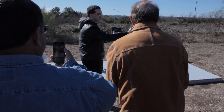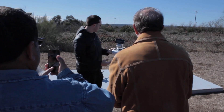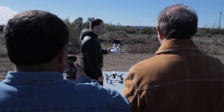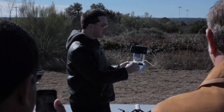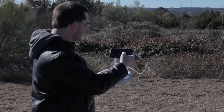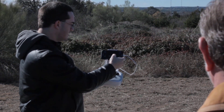Just like Robert probably demonstrated on these, we don't want to fly until we've calibrated the compass. That's a key procedure to making sure that the aircraft is going to fly safely. Compass calibration is done through the app this time, so it's not a manual switch on the controller. I just hit calibrate on the compass. It's going to ask me to make sure there's no magnetic materials anywhere near it — I know we're good on that, so I'll hit OK.